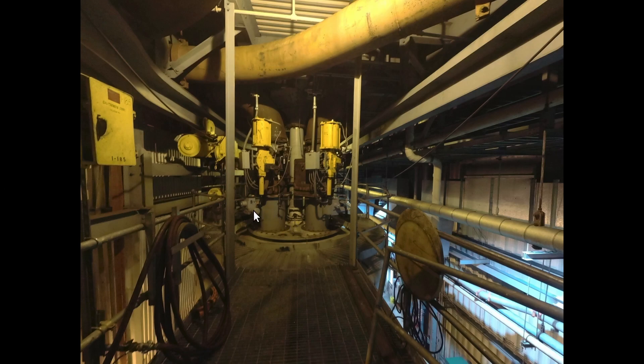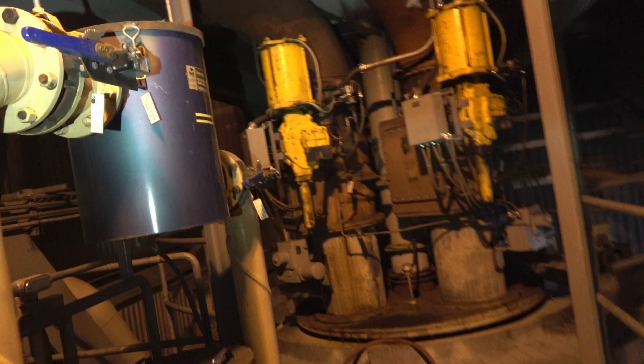These are the coal orifice valves. This one here shows the BSOs along with the seal air filter. This is air coming in off the cold air bypassing the air preheaters, off the primary air fan. You have to have really clean air because this is sealing the turntable seals, bearing seals, and classifier seals.